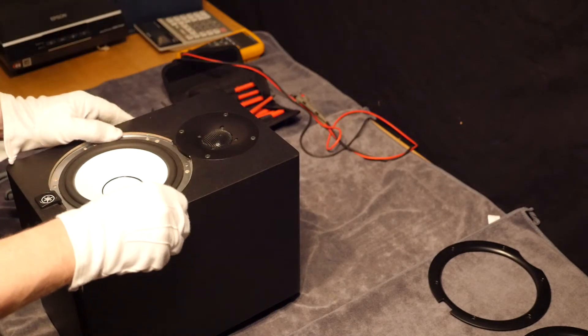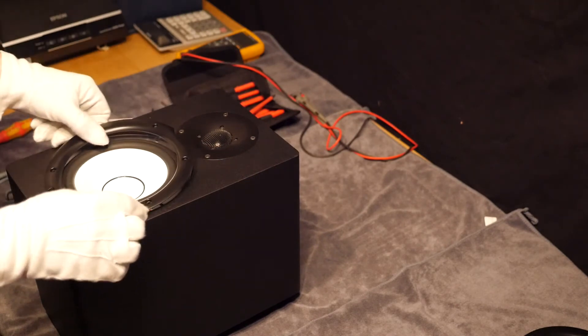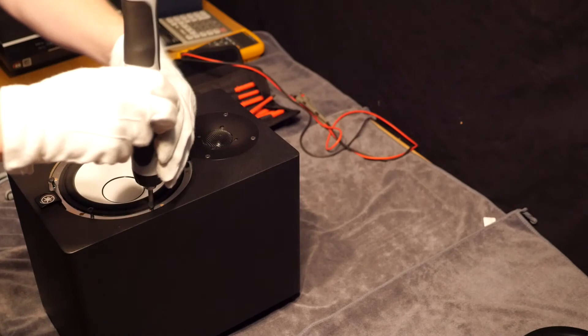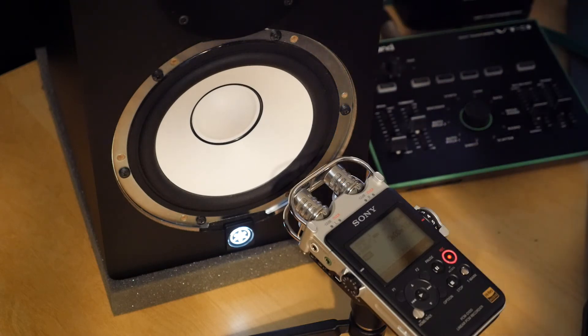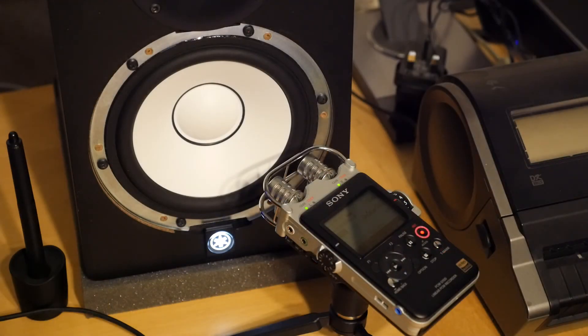I will only put the second set of fasteners in just to see what result we get. I am just going to check because those sets of screws are actually offset, so you don't want to put the screws in where the outer screws need to go. When we listen to this speaker now, I am hoping it will actually sound OK — that way I know it is not the internal amplifier and it was just the drive unit. Now that is sounding OK, so it does look like it was the drive unit. With the suspicious drive unit now in the other case, we can better hear the distortion — and we can, that slight reverberation there.